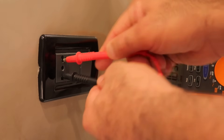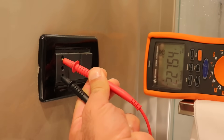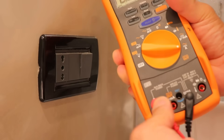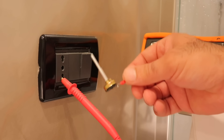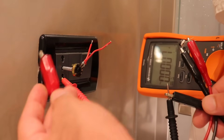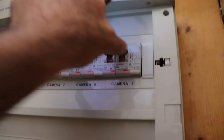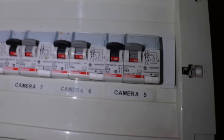Trying again. First I plug my probes in to check the voltage — tonight I have closer to 230 volts AC. I change my meter to current measurement setting to see how much current I'm sending from live to ground. I use the long shaft of my old potentiometer to connect to earth, connect the potentiometer to the other end of the meter, and now connect the other side of the potentiometer to earth to see if there is any ground fault protection. There you go — it popped! It does have ground fault protection.